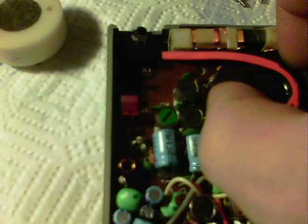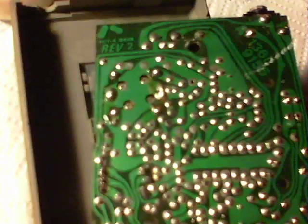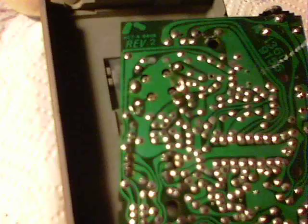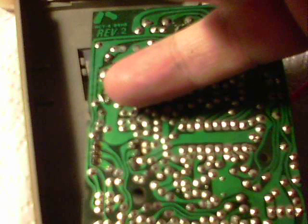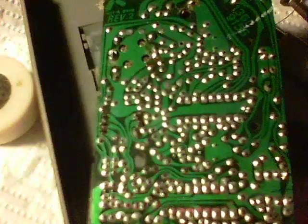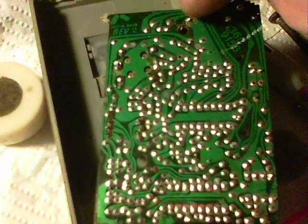Taking it apart — it's all live as it were. Here is the variable capacitor. Looking at the back, this section is the variable capacitor and the windings go to this side, so that's where I'll connect. I'll connect to the top one and the middle one. I found that these middle sections connect up to one of the pins at the top, so I've connected the start of the wire to that pin and soldered it on.